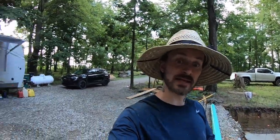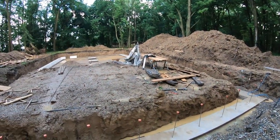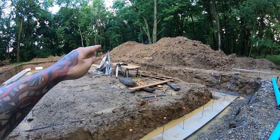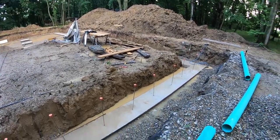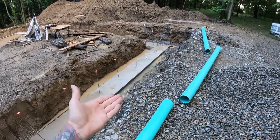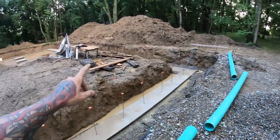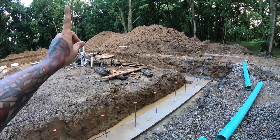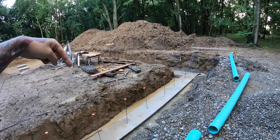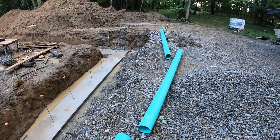Another big thing — back in this corner on the backside of the house — we are going to put a clean-out. So let's say the filter fabric ends up failing and silt comes up through and starts clogging these holes. When you put a clean-out in — basically just a pipe coming back through — you can put a garden hose or a snake down in there, get it through your French drain, and do a clean-out just in case these ever fail.